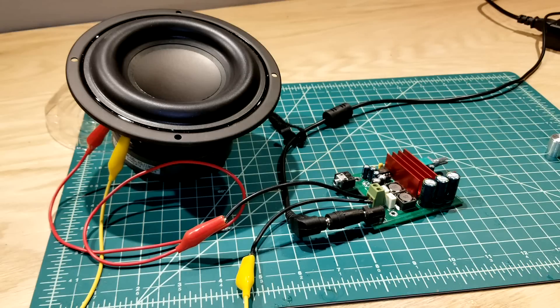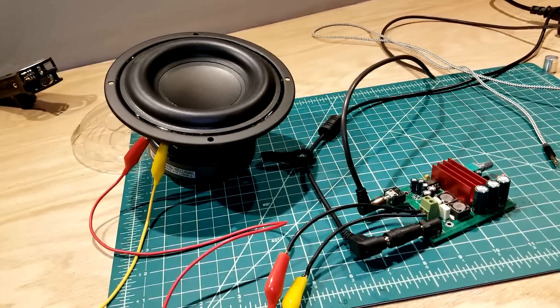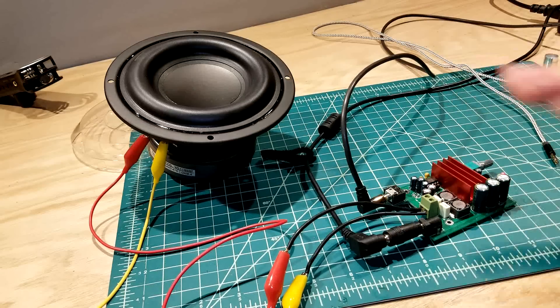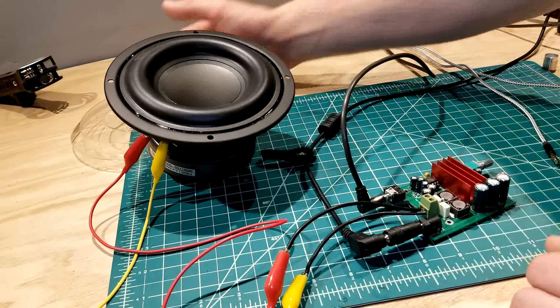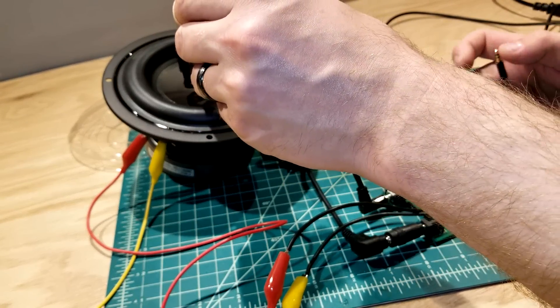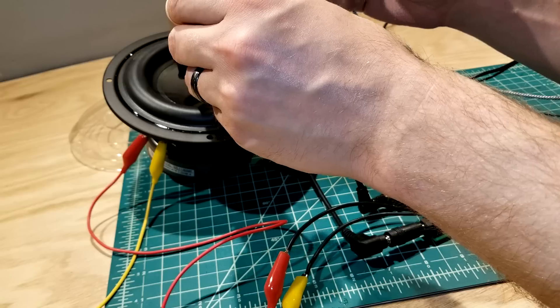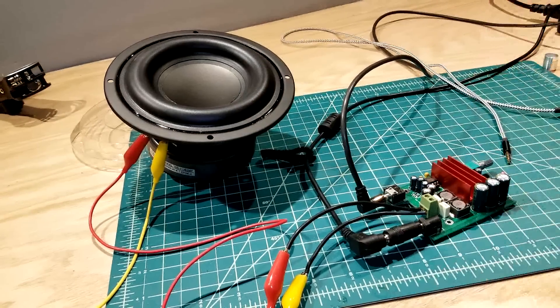There are a couple other things I don't like. The second thing is you can get some interference from this subwoofer — it really depends on your source, but I get a lot of interference from this 3.5mm jack, which is of course the only input since it's a one-channel board. There's no Bluetooth — just this jack, which really is all it needs. Let's bring the microphone closer to the subwoofer so you can hear this. That noise is from pressing on the 3.5mm jack, and whenever you add any type of input that type of noise is there. I have to get really, really close before I notice it, so I don't think it's actually going to be an issue — but it is something to be aware of.